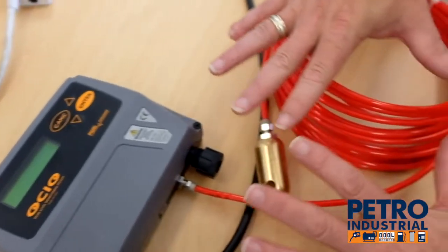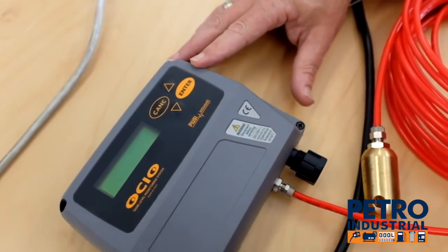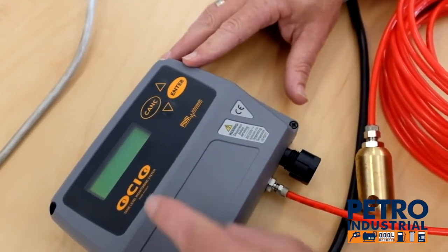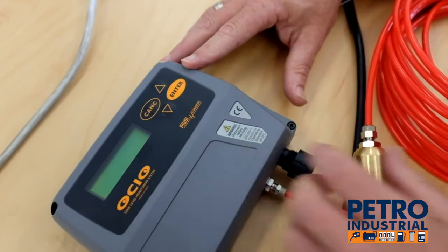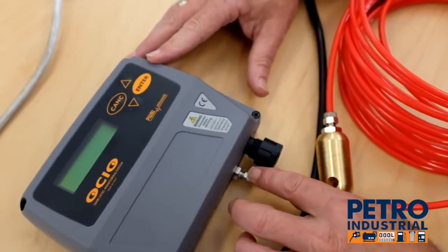At this stage, the unit is going through checking. Because it hasn't come back with an accurate reading, it shows out of range. If you get an out of range message and it's in the tank, it's been calibrated and set up — assume that there's something wrong with the air pump.